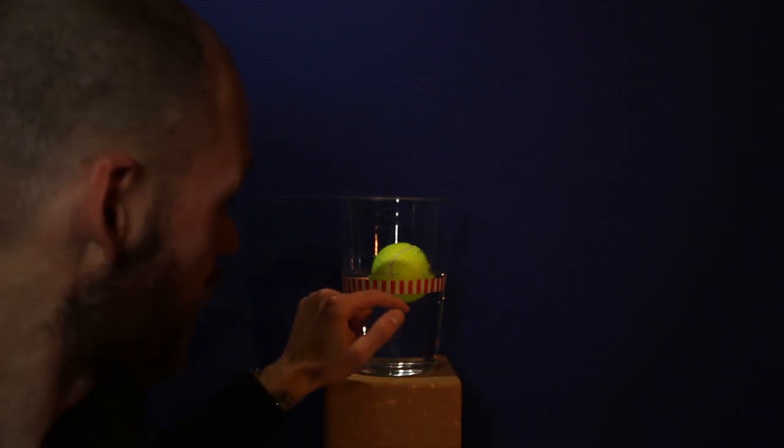The volume of that water difference is the displacement — that's what the term actually means. The displacement a hull has equals the weight of the boat. The displacement hull is the most reliable and efficient hull in rough water. It's the go-to design for ocean-going vessels — anyone cruising long distances facing rough chop, rough weather, and large waves. It has the most floating power, the largest cargo capacity, and is a classic design that has probably been around for thousands of years.